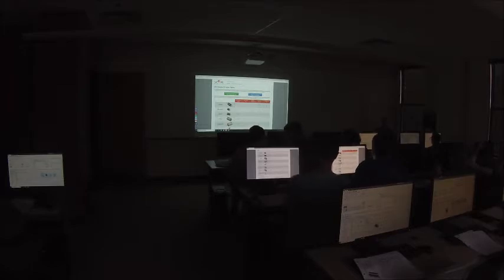They're doing some software current limiting so that when the motor starts out, it starts at a lower voltage, so you're not dumping 100 amps into it. So that's something I've been thinking about a lot. We might try it in the future. I don't know that we're going to try it this season. We might, if the game is something like we dealt with last year where there wasn't a lot of pushing and you kind of just drove around. Just something to think about.